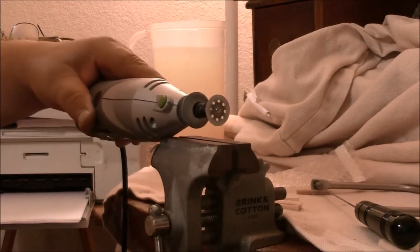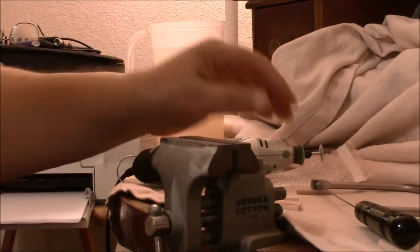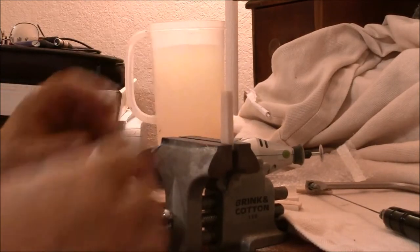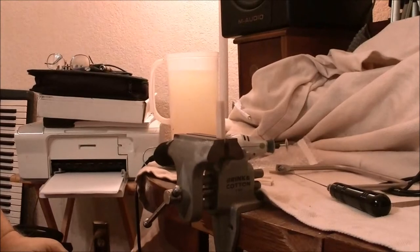And like I said in the other video, make sure that you can see your score lines on the nut itself. This one has a score line I can see to cut by. Make sure you can see that score line at all times. If you cut it away, put it right back again. Just fill in the cracks you created on the nut with a crayon or a pencil so you can see what you're doing. It makes it much easier so you don't get out of line.